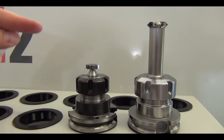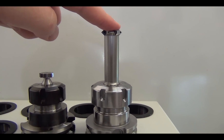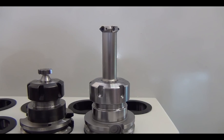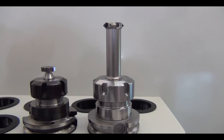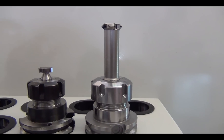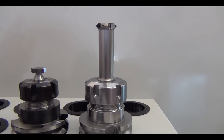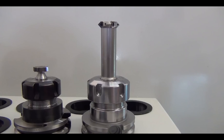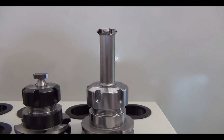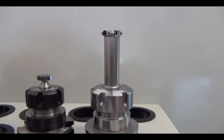I love these tools, especially this one right here. This is a tool from Big Daishowa in Japan — it's the same tool that Night Force uses to make their Picatinny rails. I had great success with it. It just rips. I'm able to cut 20 thou per tooth at basically 2,900 SFM. It really likes the fast spindle on the DM2, and it rips through the metal incredibly fast.